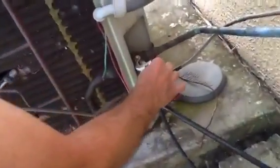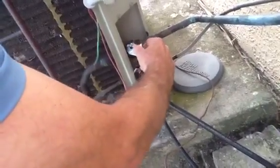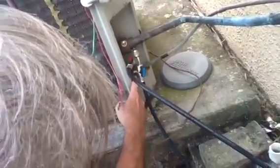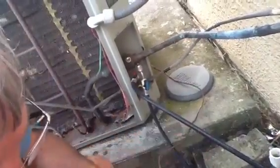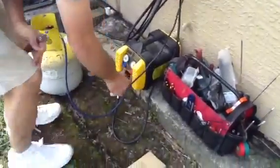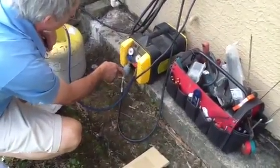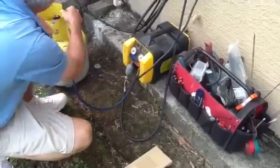Now we're going to open up the Trane valve. The key thing here is you just got to have a path to everything going to the tank, so you want to make sure everything is totally open. My technician has already opened up the valve here — it was already opened because it was under working condition. Now we have a path going to the gauges. We're going to come out with the service hose to the filter. We always want to put a filter on the recovery unit. It's going to come out and go to the tank.